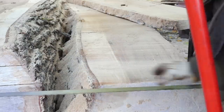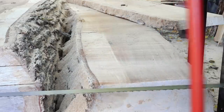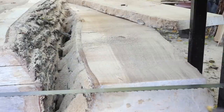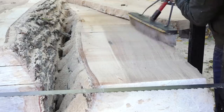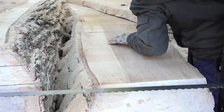This is pretty good. So it went through pretty quickly, which is always good. Fewer teeth are destroyed if you go through the inclusion at normal speed instead of trying to slow down because you know there's going to be metal there. All right, there's a couple of them in this one. These were deep in here, fully embedded.